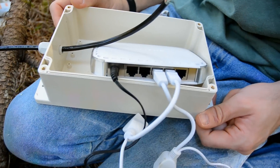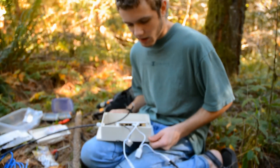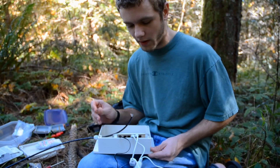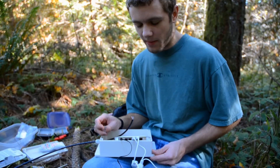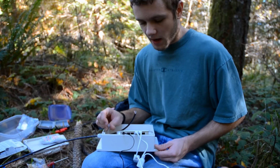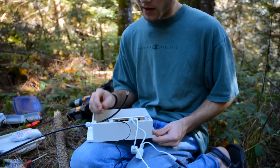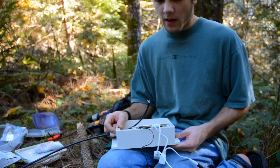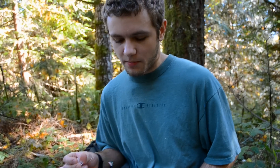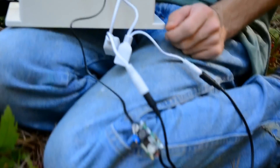It's actually pretty simple from an electrical standpoint: you just have power coming in and splitters at each node which take out the high voltage, step it down, and power the switch — it's all self-contained. One of the main things we were trying to achieve is using off-the-shelf components, which is what makes it so cheap. Essentially, this is a box that takes in power and a data line, goes through a switch, and the power and data go back out. The only thing that happens with the power line is it's split so we can power the switch with the DC/DC converter.